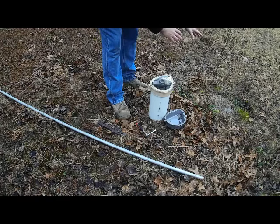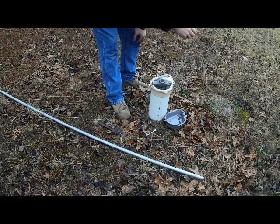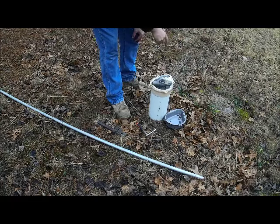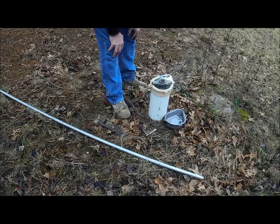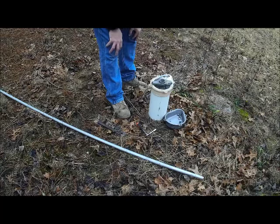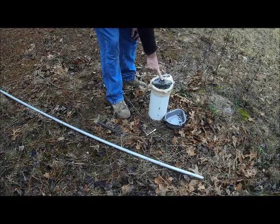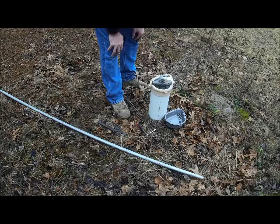So all the water going into the house, the pressure is released, and I've got the valve open down into the basement, which we'll go look at next near the bladder, and all that water is draining out, and the water's drained back into the well. So this is all done. This is all you need to do at your cap, is to relieve the pressure here, and then we'll put the cap back on, and then we'll go into the basement, and I'll show you what's next there.